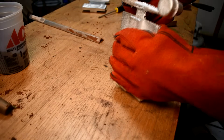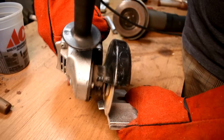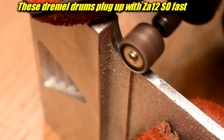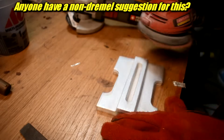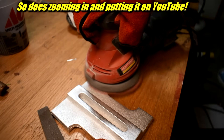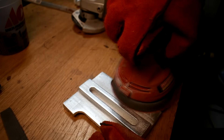Cleaning this up, I'm not going to go absolutely crazy. I had just very little excess flashing on this part, which I hit with a flap disc. Flap discs are the best way I found to deal with metals that gum stuff up. I had the pattern shift a little bit, so the sides took a bit more work — probably my fault for making those pins a little too loose. Then I basically knocked down the roughest part of the sand texture. Knocking down the sand texture is a really good way to expose flaws like bubbles or trapped sand — it's like removing the camouflage. Grinding is for hiding your shame. Sanding exposes it all.